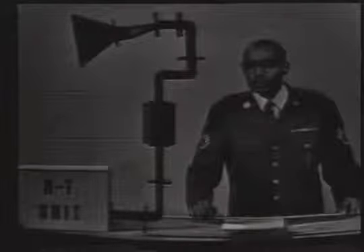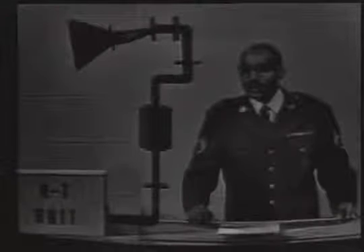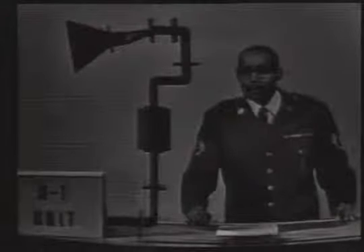So it's important that you be familiar with the physical construction and the electrical operation of the different components of the system. During this lesson we will discuss the choke joint, the rotating joint, the feed horn, and the dummy load. We will also identify E and H bends in a waveguide and see what happens when the waveguide is improperly bent.